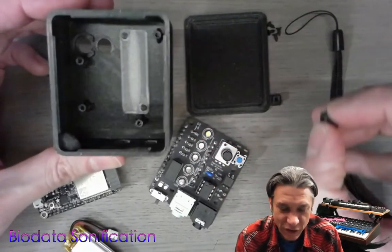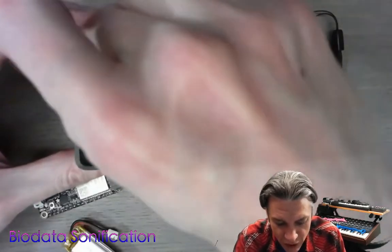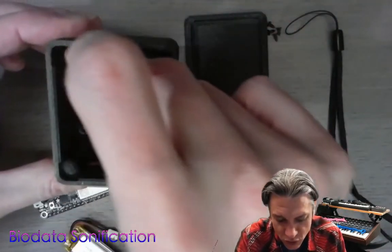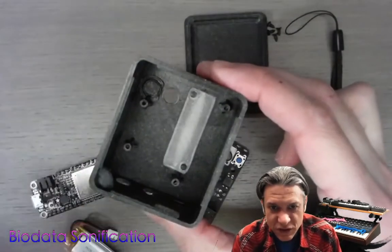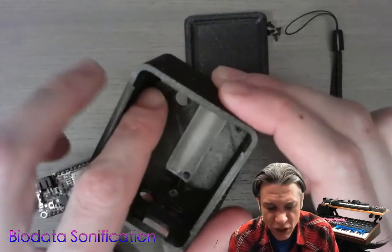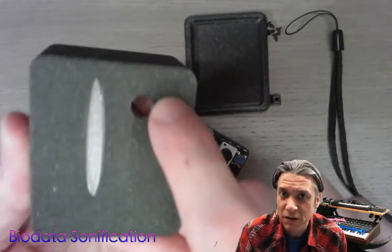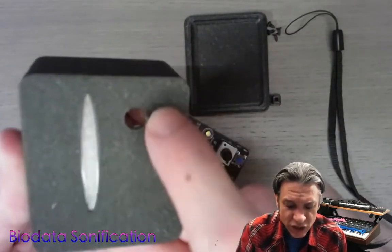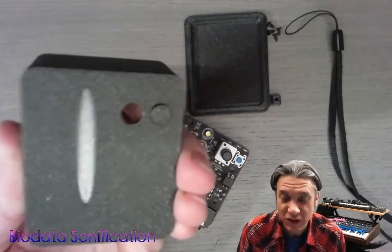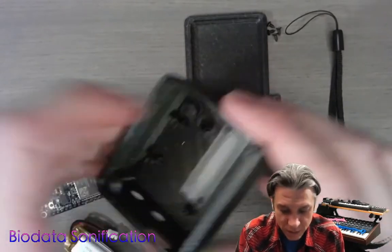With that in place, now I'm going to take one little button here. There's a flatted side on the button and that flatted side faces the standoff. Inserting the button isn't too hard. Once the button's inserted, if you've 3D printed this yourself, depending on the tolerances of your printer, you want to hold it in with your finger and then press the button component in and out a few times just to make sure that it slides freely.